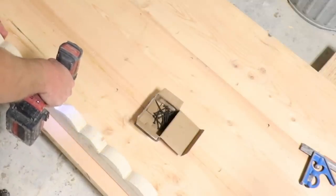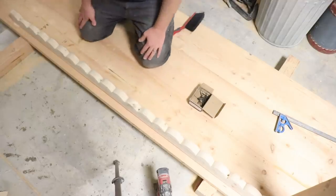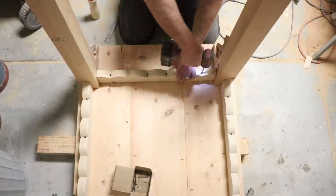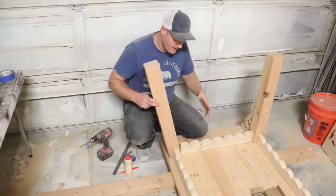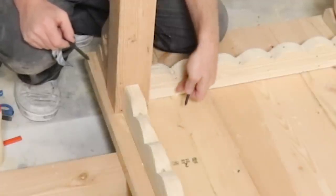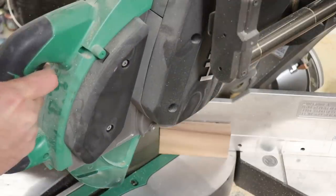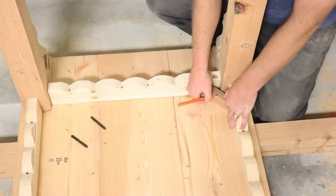I'm going to put a couple right here in the middle of the skirt. The glue always helps. Make sure everything's lined up again before I commit to putting screws in it. It's almost looking like a table — it's upside down, but it's almost ready to go. The legs are not secured yet. I've got some 5/16ths by 3-inch hanger bolts which need to go in here, and then I've got to put a bracket across here so I can tie them in. I've got 5/8ths pecan — you can use oak, you can even use a common pine board. I cut 45-degree angles opposing each other and this is going to slide right up in here. I'll screw this in and mark right here where the center is so I know where to put my screws.